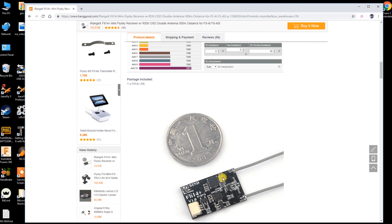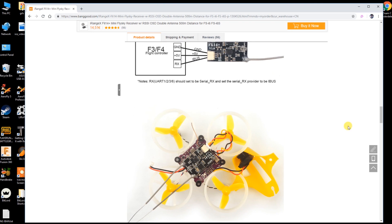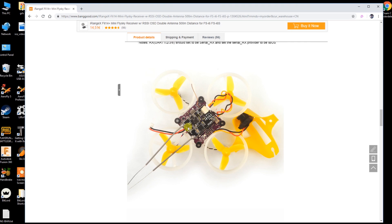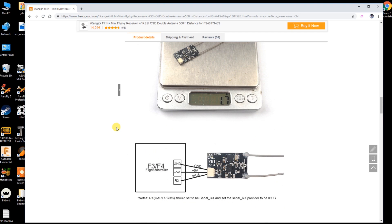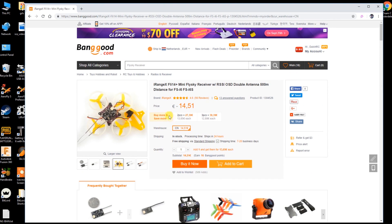Nice and small, so it should, even for the smallest of drones and quadcopters — here's a very small indoor quadcopter — this receiver is kind of too big for this very small one. But for your three inch, two inch, and obviously larger drones, this receiver should be an option. It has telemetry, regrettably not battery telemetry. I'm not even completely sure how that works in the FlySky realm — maybe you can inform me — but it has RSSI telemetry.